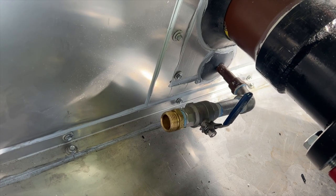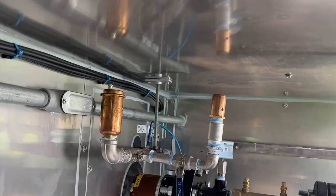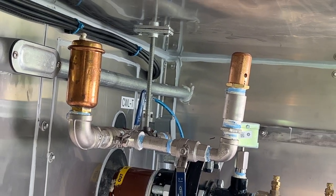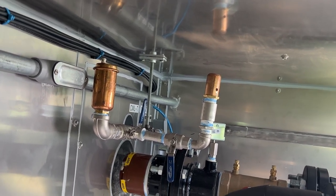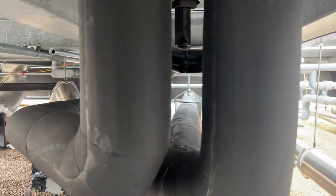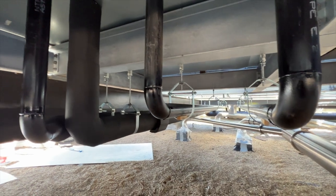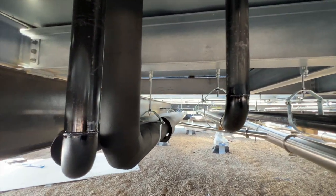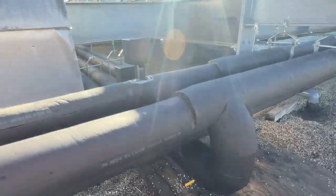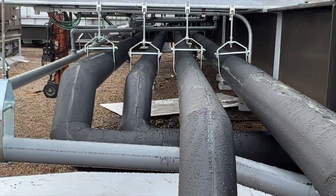While Corey's welding, I'm up in the cabinet screwing together these half-inch stainless steel drains and vents. On the bottom, I have low-point drains with a hose connection so the coil can be completely drained if needed. On the top side of the water coil, I have an air bleed to get all the air pockets out when it fills up, and that tees off to a vacuum breaker. I cut 24 six-inch holes in the top and bottom of the cabinet floor for penetrations. The ones with inch-and-a-half insulation are the glycol supply and return, and the other two are the tower water supply and return, which get one inch of insulation after heat tracing — that heat trace prevents the water from freezing in the winter.